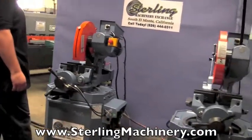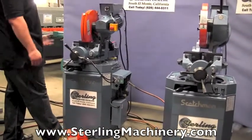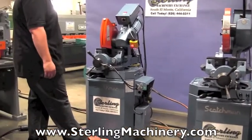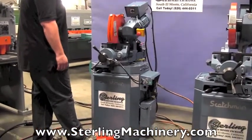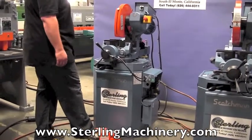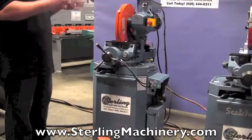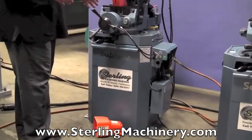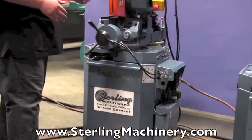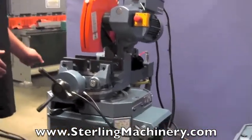I'll show you how it works really quickly. It's very easy to go ahead and set up an automatic feed if you wanted. Otherwise, you just set it up like that, they go through it, you go ahead and shove it down and complete the process again. All you have to do is step on it one time. The head will come down, the vise is already clamping. Once the head goes down, it retreats, and the vise will open just enough to let your piece go through.